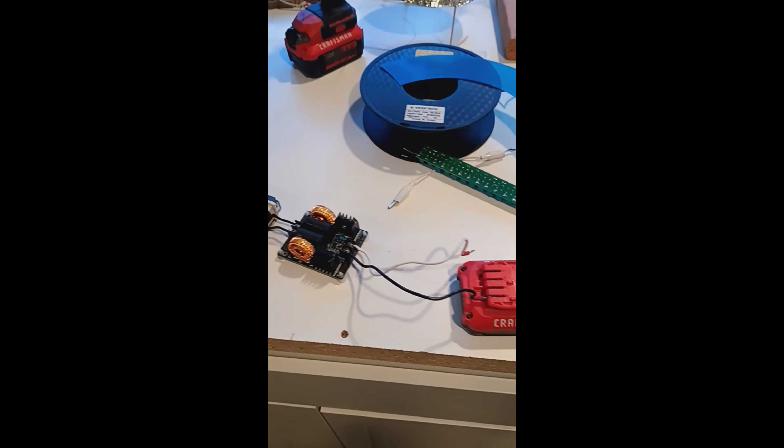You wrap it right here — here's your core. That's an AC flyback right there, made for high voltage — trust me, it's a good one. This right here is a voltage multiplier. This rectifies the AC into DC so it can arc through the air. Anytime you build a multiplier, it rectifies the AC coming out of the flyback to DC.